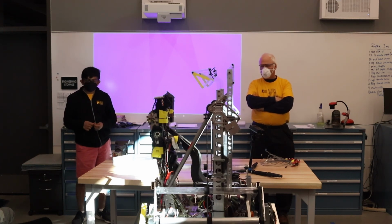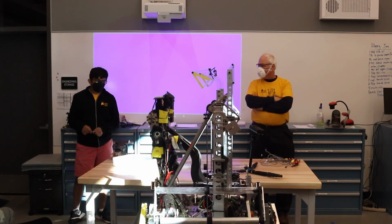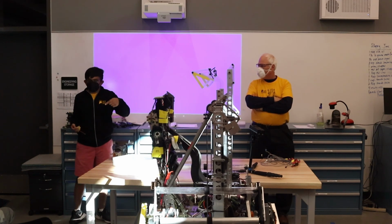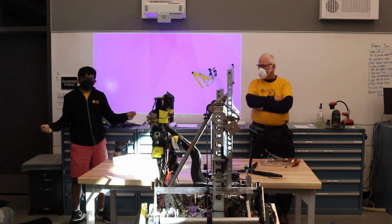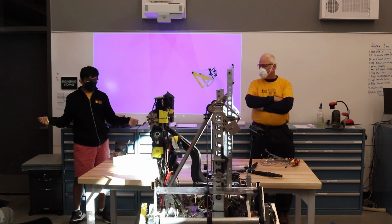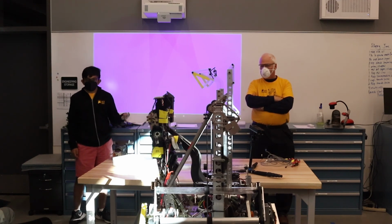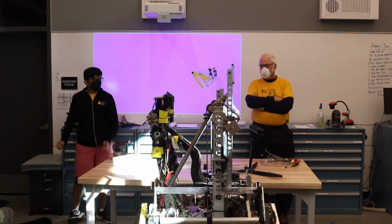Yeah, and another interesting thing that we did with our power is we made one of our motors this year right next to the PD board with an Anderson, so we could connect it using a power supply. It allows us extended testing. You don't have to swap out the batteries, so this is just really helpful for us. For example, during shot tuning, or if you're just prototyping the software in a specific intake or whatever, it's really handy.